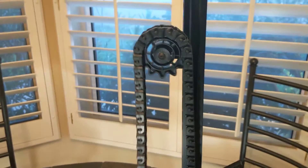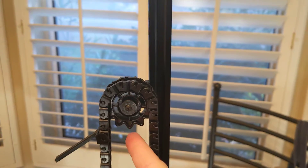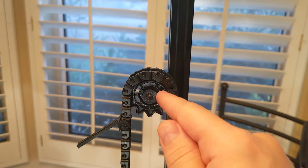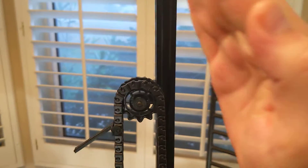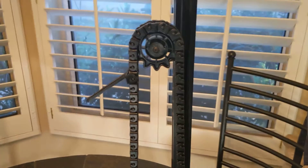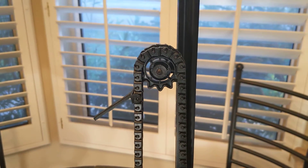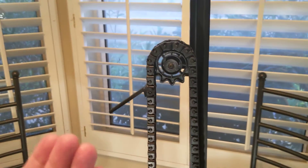A couple of issues. If you listen closely, there's a knocking. What I believe that knocking is: on the spoke — I'm using the original spoke from the kit because it's nice and plastic injection molded, very sturdy — there's a square hole in there and a round axle, and the sound is the square hole essentially knocking and settling over every time it comes over center onto the round axle. I'm going to create a square-to-round adapter to make that axle hole round, which should eliminate the knocking. I think there's also a lot of additional friction because of that.